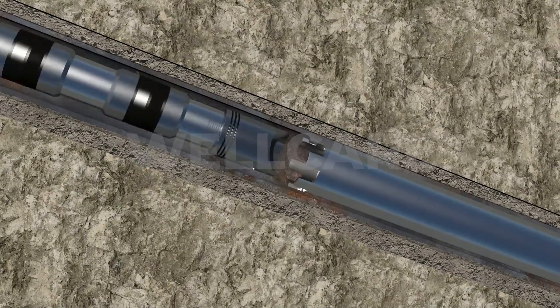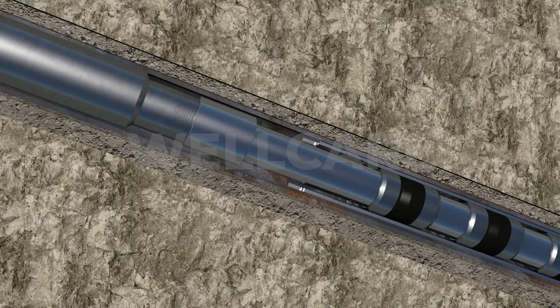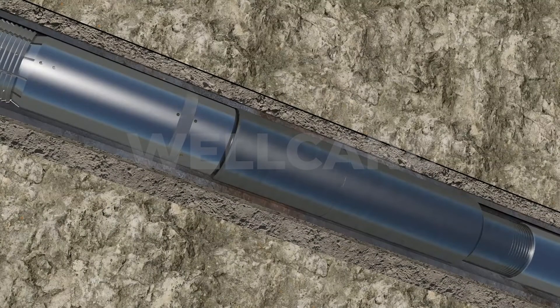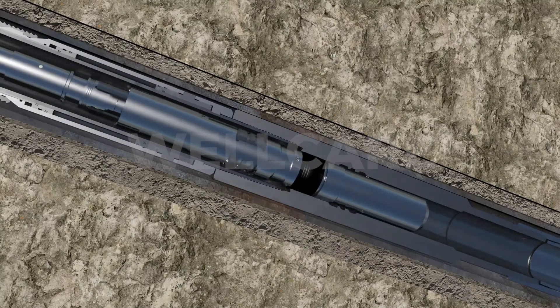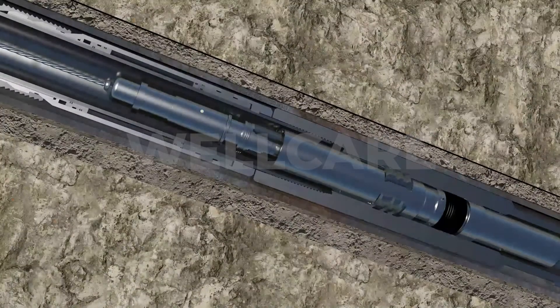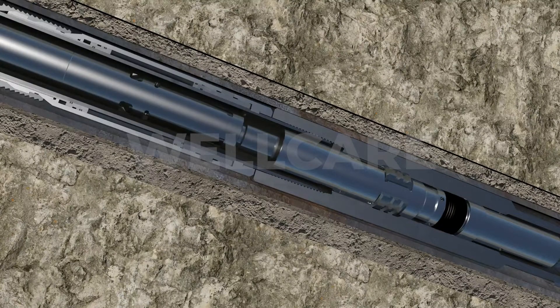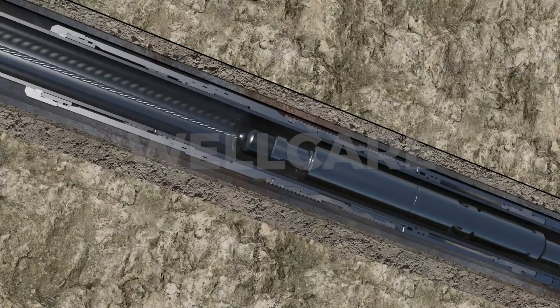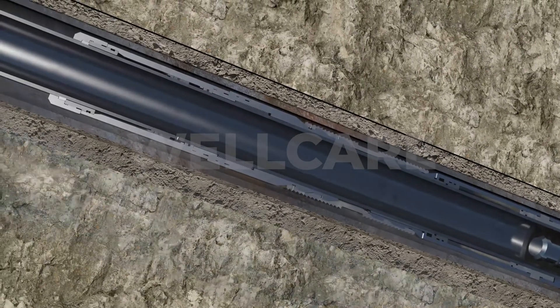In the third trip, the hydraulic tie back seal nipple with hydraulic anchor, tubing retrievable safety valve, and tubing string are run into the wellbore. Space out will be carried out prior to setting the tubing hanger accurately. To set the hydraulic tie back seal nipple with anchor, the string ID needs to be plugged using a blanking plug. A lock mandrel is conveyed through slick line and installed in the nipple profile. A prong is then installed in the lock mandrel to plug the ID of the completion string so as to build the pressure to set the hydraulic tie back seal nipple with anchor. Hydraulic pressure is then applied to shear off the brass screws, activating the hydraulic anchor.